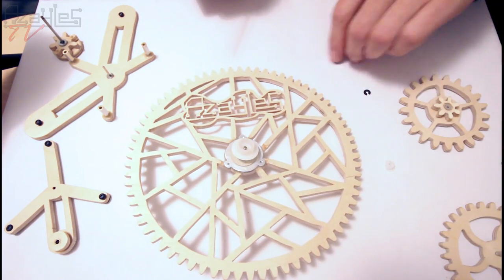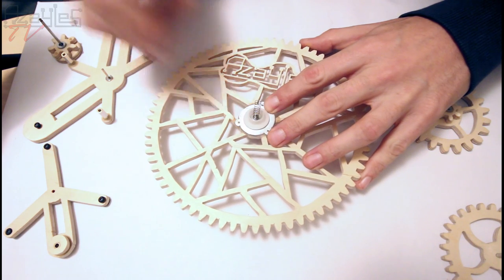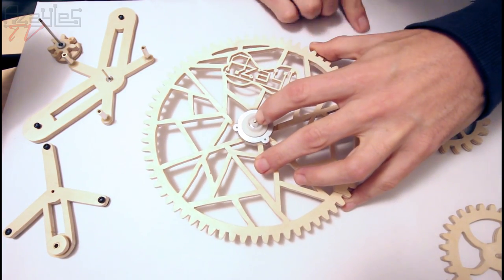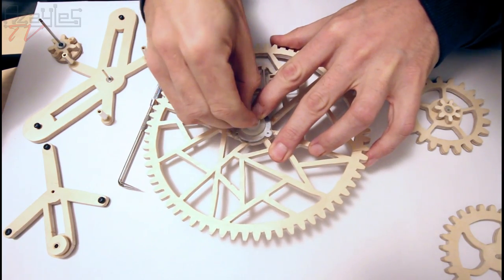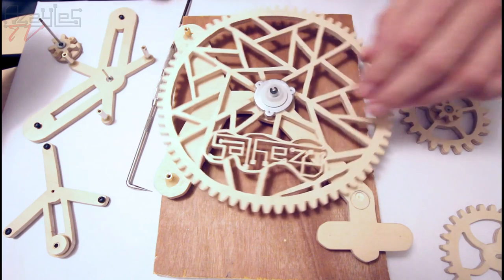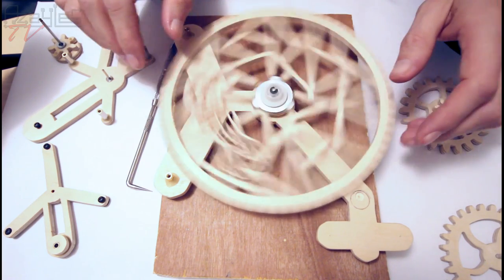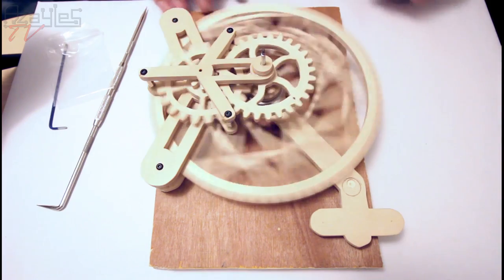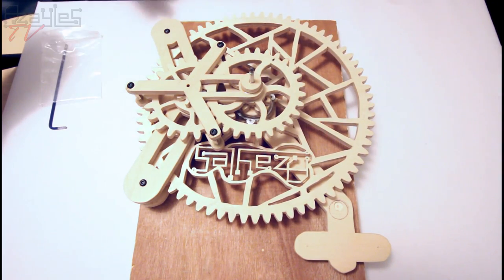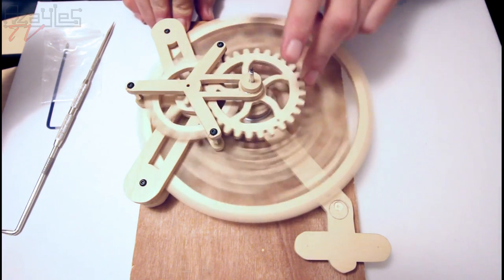Here we go. No, you stay there. Good. One washer ought to do it. Let's see. Bit stiffer. Hopefully that will solve a few problems. Let's reassemble it and see. Yep, just one washer. That's made all the difference. It still wobbles slightly, but not nearly as much. And it's no longer rubbing on these supports here, this gear. So that's something. I can even back drive it, which I couldn't do before because things were binding up.